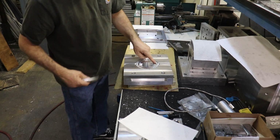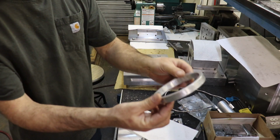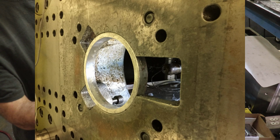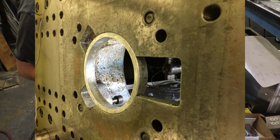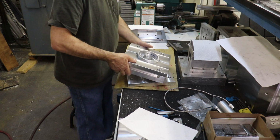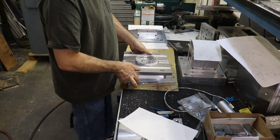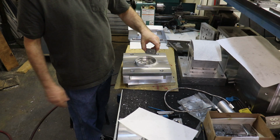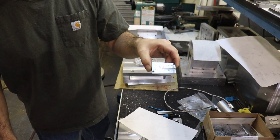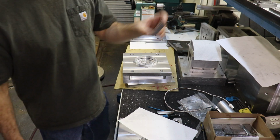And then finally, we machined a bunch of features in the back here to use our reference ring. So this ring basically keys into a reference ring in the injection molding machine itself on the A side platen. And we needed that to basically be a reasonably good fit on the back of this mold as well. So this is where we are at for this week. And some additional work that was done offline are all of these inserts, which I am going to be showing to everyone soon. Yeah, this insert, plus three other types or variations of this steel insert.